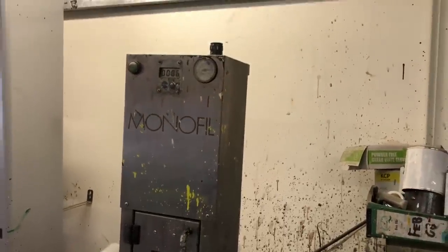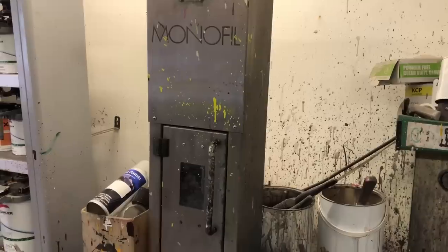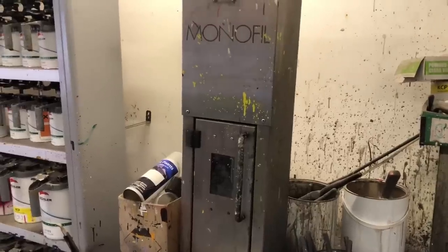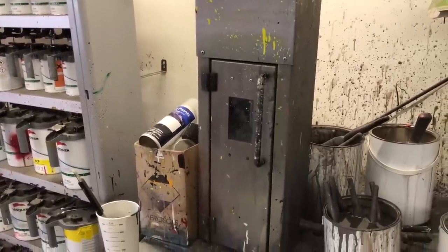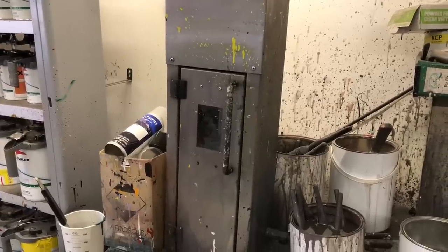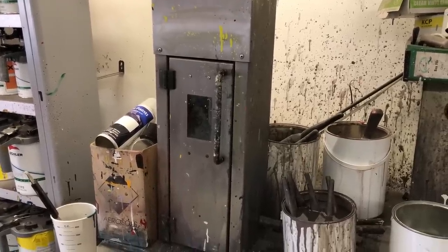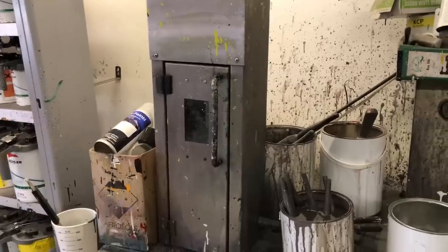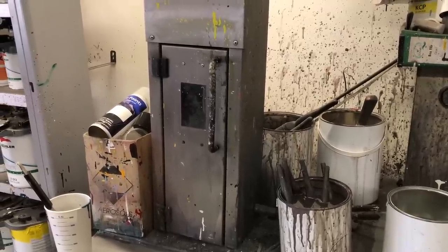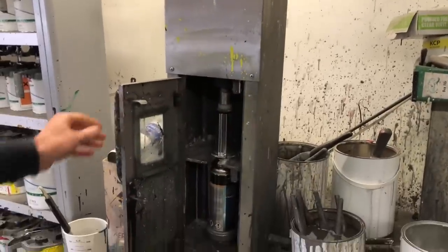We have to alter this sometimes because two-pack aerosols are bigger than single-pack ones. We have it all set in place, shut the door, make sure it's all carefully shut, and we press the button. So that process is pressurising the paint into the tin. It's got a countdown timer there. Once it's all done it says it's finished and it will stop. It's all done by our big compressor - we have a couple of hoses leading into the machine to allow the air to pressurise. I normally give it two pumps because then I know it's fully done. And that's now already finished - exactly the couple of minutes you said it would take.